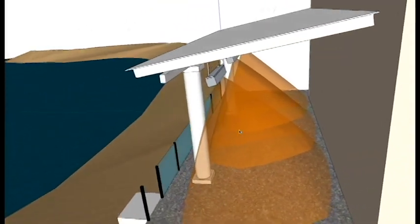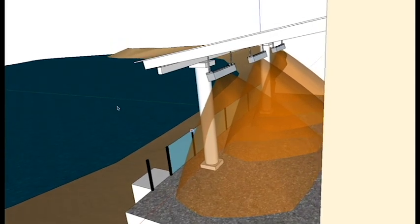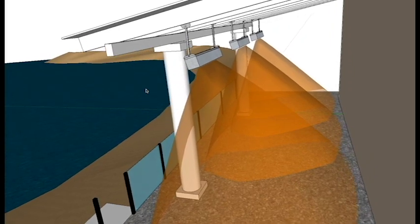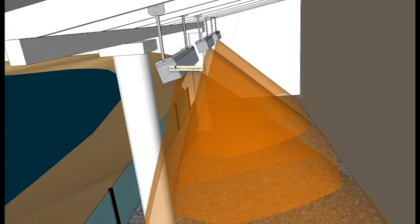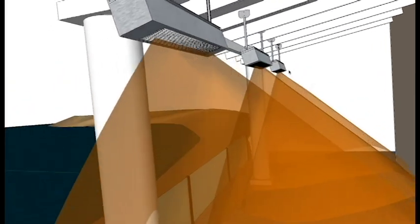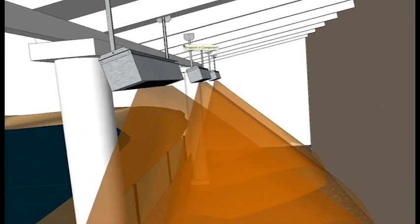Now I know this location, again, as I stated, is up by the beach, and there's a lot of wind that comes through this channel here from the waterfront. And what I'm afraid of with this application is that the wind will start pushing into the heater back area here. There's a vent right here, and it'll start forcing some of the exhaust product down through the face of the unit, and that could cause damage to the grill, as well as when it's more than a breeze.